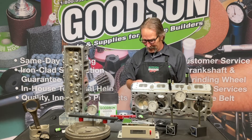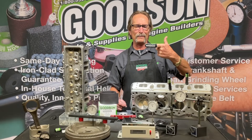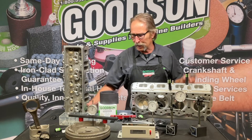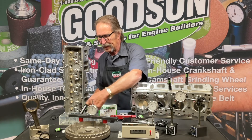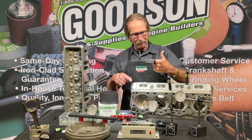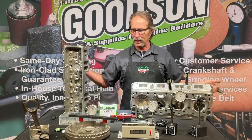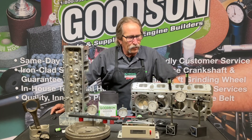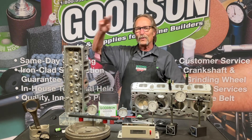There's one thing I've been wanting to do for a long time — let me show you the finger right here. This is our little RW Mag. We came up with this quite some time ago. It's got Goodson written right on it, with a little magnet right here at the end. So if I'm assembling one of these multi-valve overhead cam cylinder heads and I've got all these keepers down in here, I can just reach down and grab those as I need them, find the one I'm looking for, put the rest of them back, reach back in again as required — rinse and repeat. So that's our little RW Mag. It doesn't do much understanding just looking at it in the catalog on flat paper, and that's why I wanted to bring it out in this discussion of magnets, because magnets play a role in the machine shop — we need them to just save time all the way around. If you have any questions, you can catch us on the web at Goodson.com or call us at 1-800-533-8010. Thanks for watching — we'll see you next time.